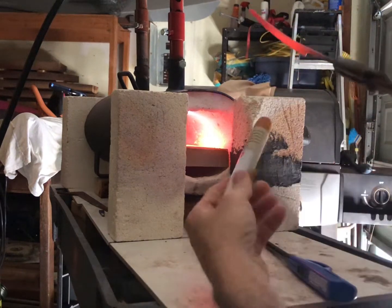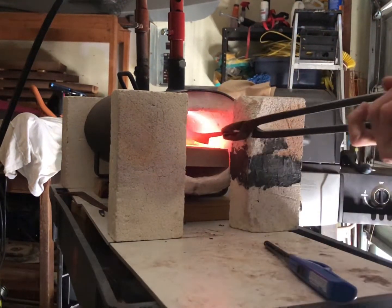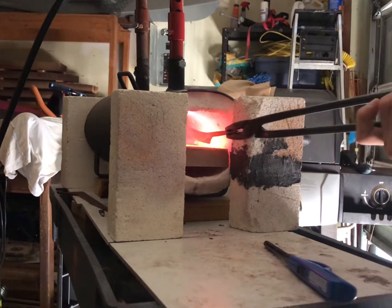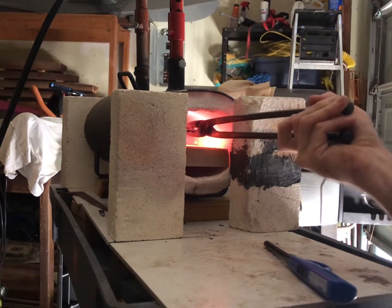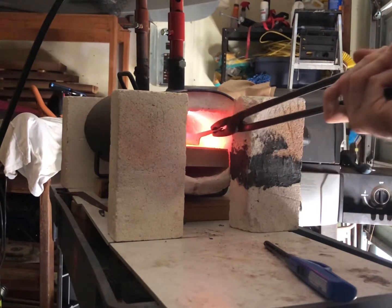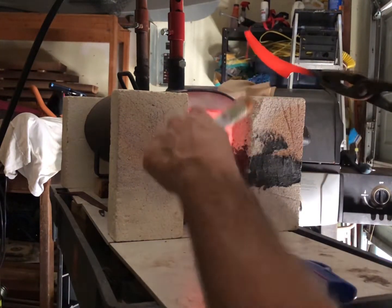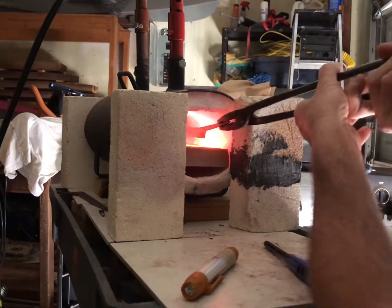So I need to see when it's non-magnetic. Right now it's magnetic. Once it's non-magnetic I'm gonna try to heat it a little bit hotter and keep it there for as long as I can, but probably not more than five minutes, even though ten minutes would be ideal. It's just about non-magnetic — not quite.